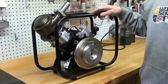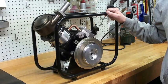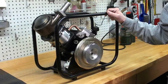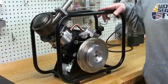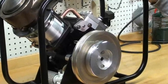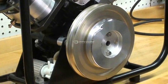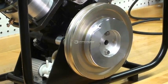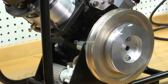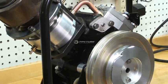This is the SV2 Mark II Stirling engine project. This is an air-charged Stirling engine in an alpha configuration, based off a Chrysler RV2 auto air conditioning compressor. This engine runs at higher than atmospheric pressure, and its maximum pressure capability is 175 psi — that's the design pressure this engine is to run at.